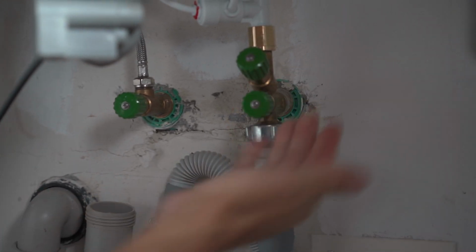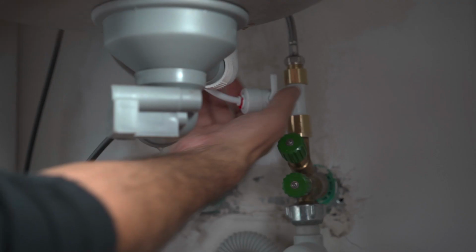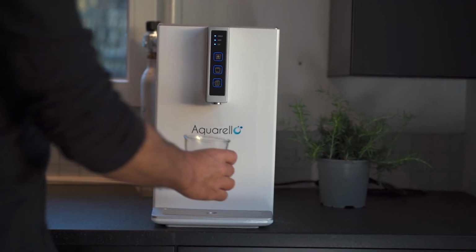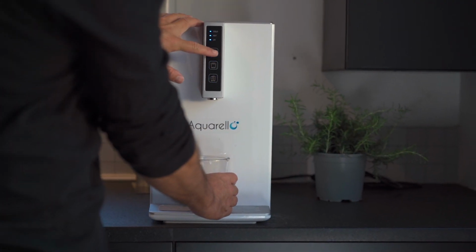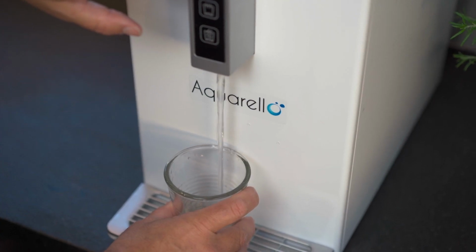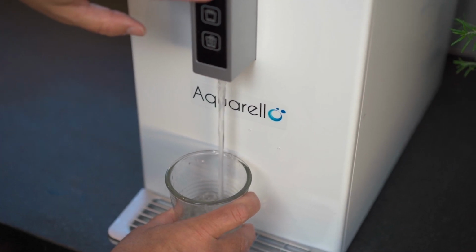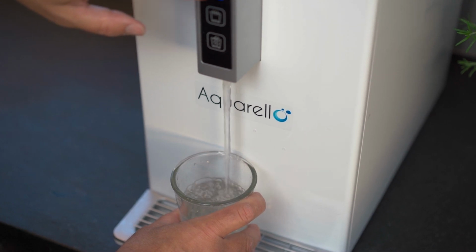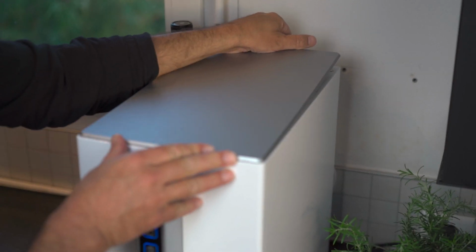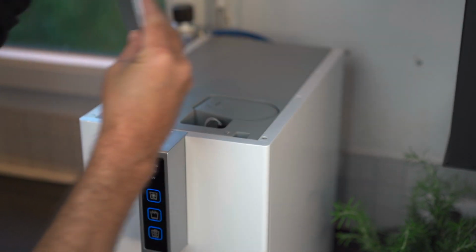Important! Please turn on the two switches, hot and soda, on the back of the device only after you dispensed all water selections. The carbonation of the water takes some time. The device is ready for operation after approximately 30 minutes to keep the water quality up to standard.